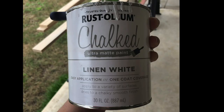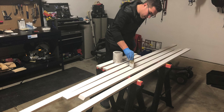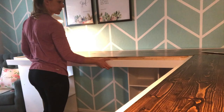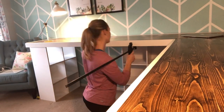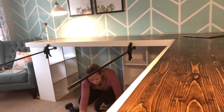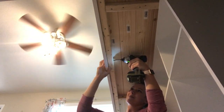Last step was to paint and seal the outer perimeter boards — my husband helped me do this in the evening when I was doing the final coat of the wipe-on poly. Next I screwed the perimeter boards onto the perimeter of the desk. I used clamps since I didn't have anyone to help, and then from underneath I drilled pilot holes and used two-inch screws to place the boards onto the front of the desk without them showing through.